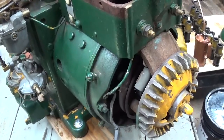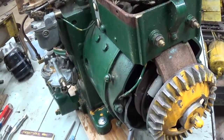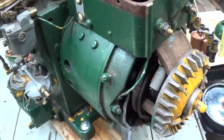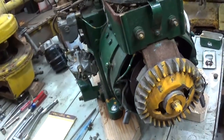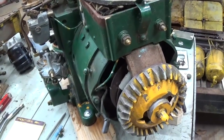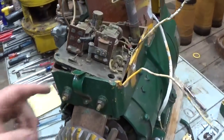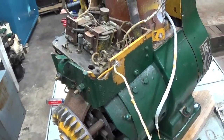Well, in that case, if somebody would have plugged it into this, the chassis would have been ungrounded, essentially, so it would have been at potential, above ground potential, and if you were to touch the chassis and your feet were grounded or your other arm was grounded, that could have really killed somebody, to be honest with you. So I'm going to have to get that changed out, and just remember that for the future, everybody.